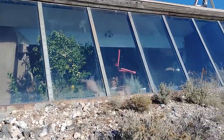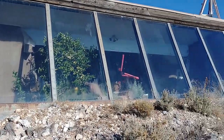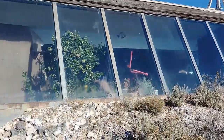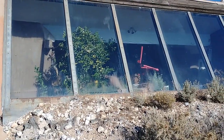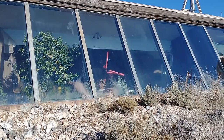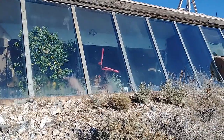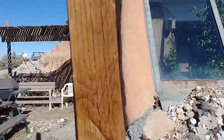You've got the start of it right here — these are about six-foot-tall windows all down the south side of the house. This is allowing all of the sun in, and it's going to heat the floor and the walls inside. All that solar mass is going to absorb the heat and then let it escape back into the house overnight when the sun's down.